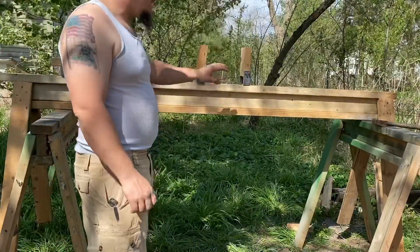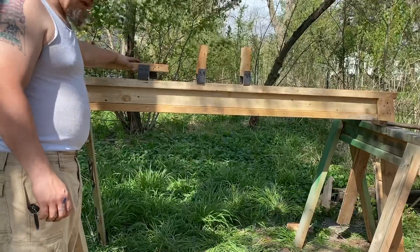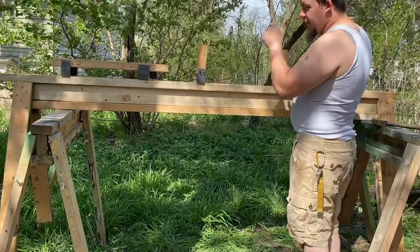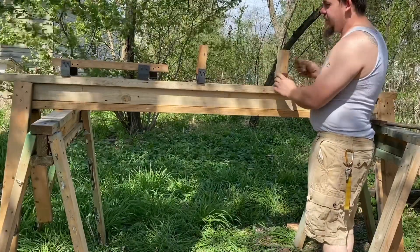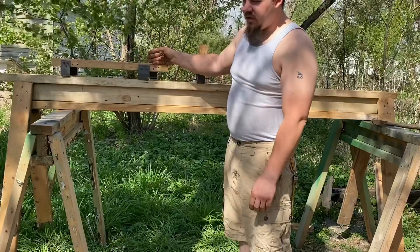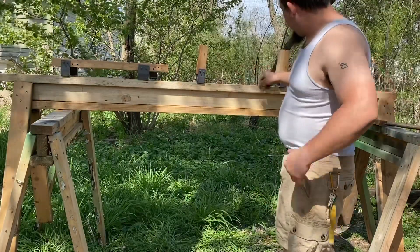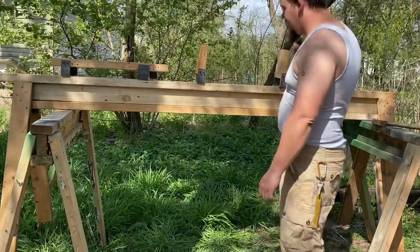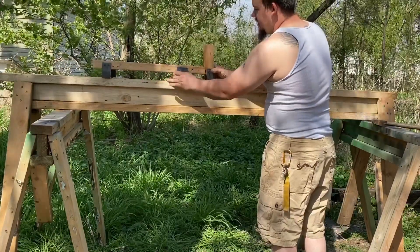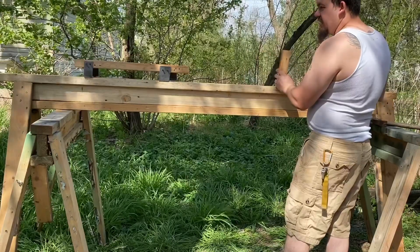I didn't bring you along for attaching these — it was more tedious than I thought it was going to be. But here's the general idea: you've got your barrel clamped down to this carriage. Here's your two slotting drill bit guides, and they aren't drilled yet. When I get the drill in place, I'm just going to let the bit drill them. I'll measure the height of where the drill bit is sitting, clamp the barrel so it meets equally in height, then probably pre-drill these at that same height. As you move the carriage along into the drill bit, slide them forward — or I'll just move them by hand, advancing them along the drill.